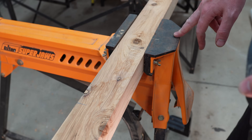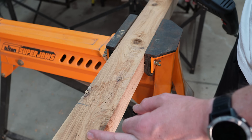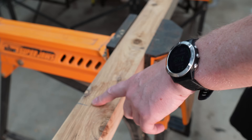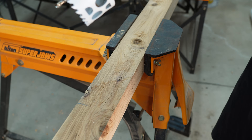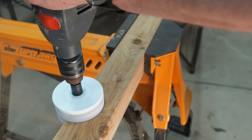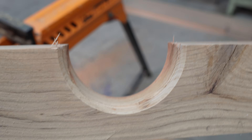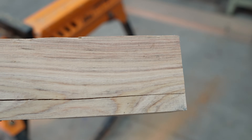I've marked out two lines, 14.5 centimeters in from each side, exactly 55 centimeters apart — that's the center-line spacing we want for our grow tubes so they flow back nicely into the IBC at the same width. I've got the 92mm hole saw attachment on the drill and I'm going slightly down from the top so the drill can get into the timber. And as you can see, it gives a really effective 92mm hole — our grow tubes will fit in there nicely. I'll give them a sand and clean-up, then bang our holes in the bottom for the legs.